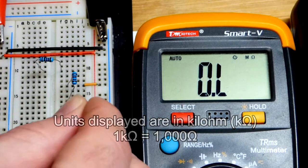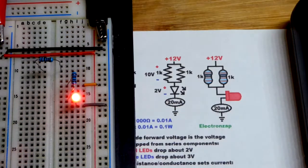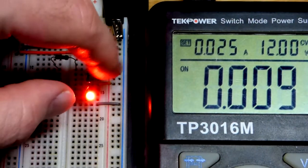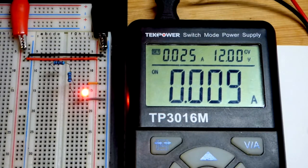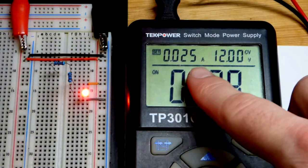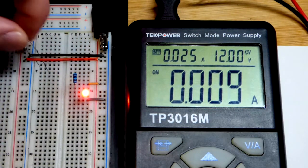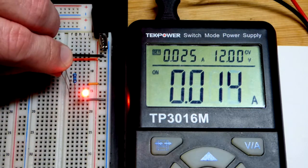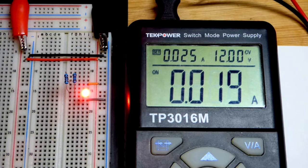Putting the LED back and switching to the power supply for current measurement. We could open the circuit to measure current with the multimeter, but we'll use the supply readout. I normally limit current to 20 milliamps on my power supply to protect the LED, but we're going to get really close to 20 milliamps with two parallel resistors — and there you can see it reads 20 milliamps.